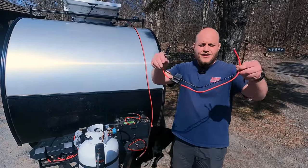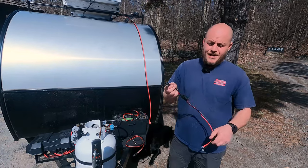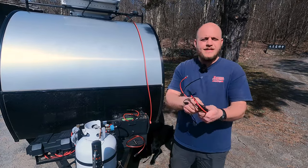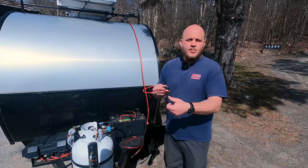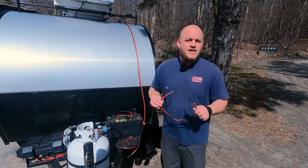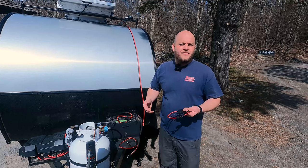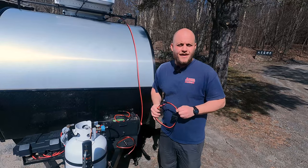Moving on to the battery connection, we're going to start with this iGreely plug — I'll put it in the description. It's 10 gauge wire that goes to an SAE plug, connects to the battery easily, and has a nice high-quality fuse holder. It comes with a couple of fuse options and I'm going to be using a 30 amp fuse. That's going to protect the battery against shorts or damage but it's not going to limit the potential of the charge controller. You could go with a 25 or a 30 — either one will work fine.